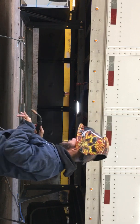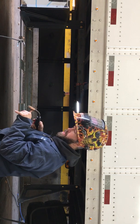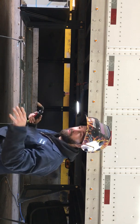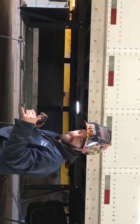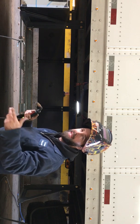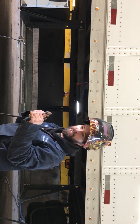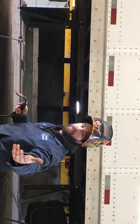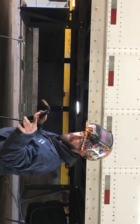So what you do, it fits in my hand. If we're walking this here, I make my backward C's. If y'all can see, I'll make a big motion here. Because a lot of these pros out here, you don't really see their little motions. It looks like this. You guys can barely tell if I'm moving. If you watch a weld video on YouTube, all it looks like is this, unless you got a guy that's right up close on it. I ain't wanna burn my camera up on my phone yet, so you don't get to see that just yet. But my motions, back to that.